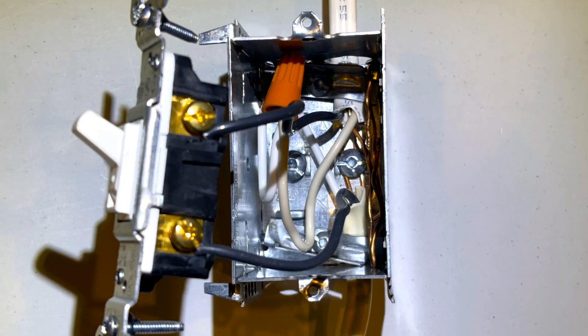Remembering the wiring in a single box that just has one cable in it, well that's no problem. But once you get above that, maybe even a simple switch, you've got to remember which wire went to which side of the switch. And don't get me started when you have three-way switches, or dimmers, or multi-gang boxes. It's impossible to try to remember that in your head.